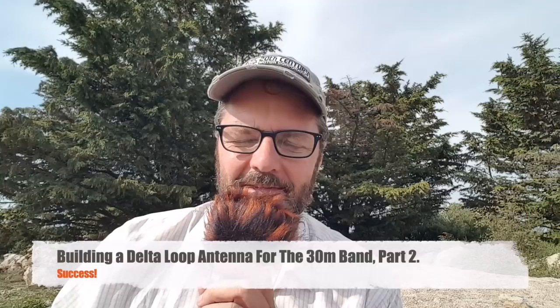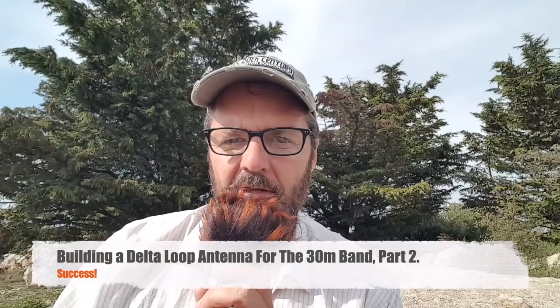Hi, this is Gilly, Radio Prepa, and I'm here at the Caldez, which you have seen many times in my videos. Beautiful place. But I'm here to test, actually fix, my delta loop antenna for 30 meters. The first wire I cut was a little too short, and I cut a new one, and this one is much longer, 30.3 meters actually.